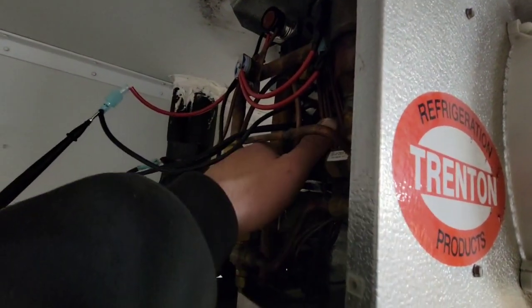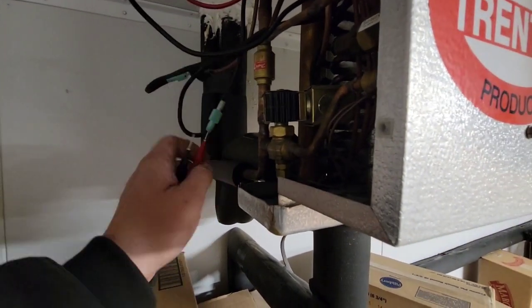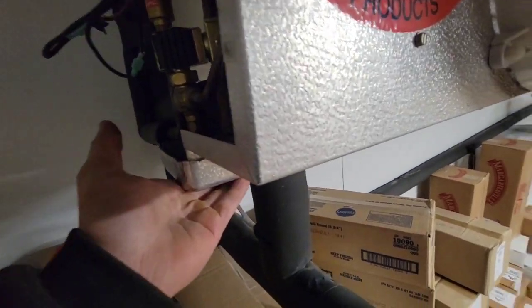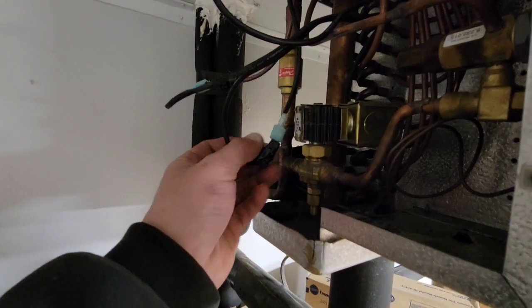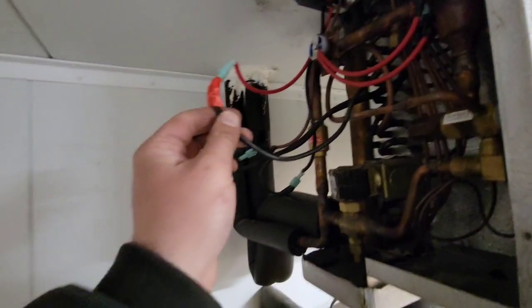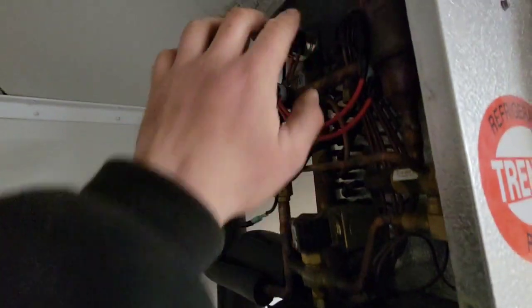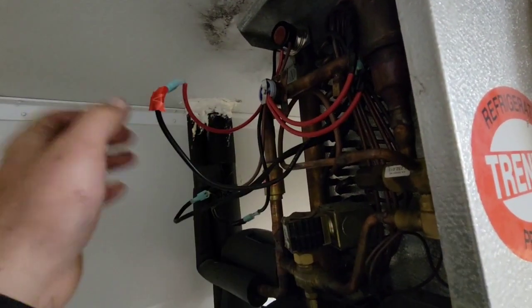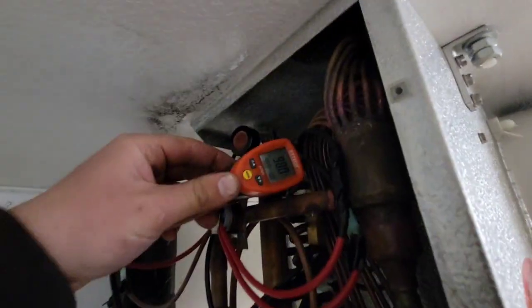As you can hear, the refrigeration has started back on, so I'm going to have to go and turn back on the defrost so I know what state this is in — I know it should be calling for the drain pan. I just put black tape on that one, red tape on this one, on the side that's going to connect over there. We're going to check continuity to see if this is doing what it needs to do. First we're going to take this temperature here — it's 98 degrees.